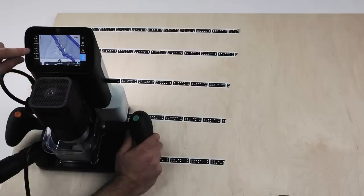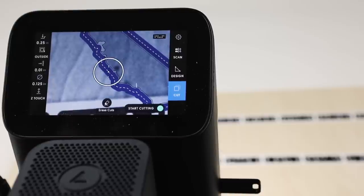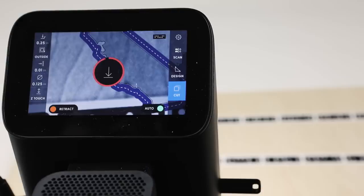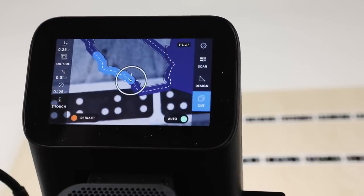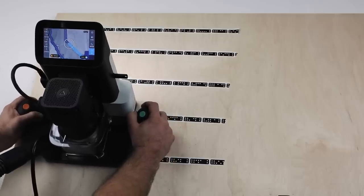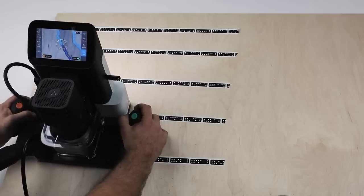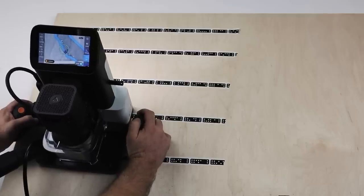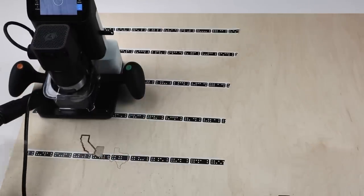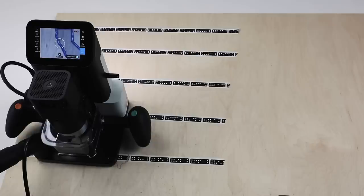So I'm going to say 1/4 inch deep, and I'm going to leave the offset the same, so our roughing passes are identical. So next pass. So we'll do this at the new depth, 0.375. So I select depth, 0.375. Okay.